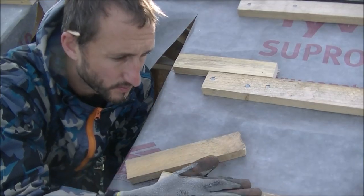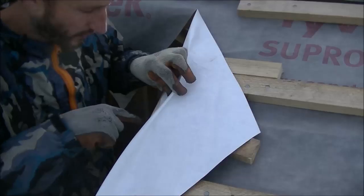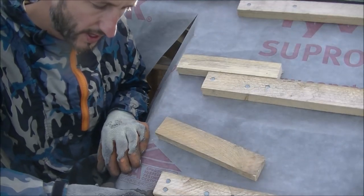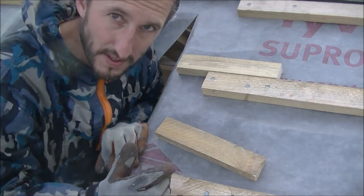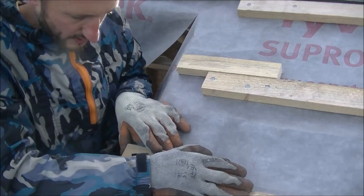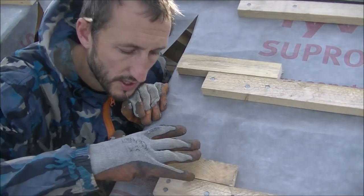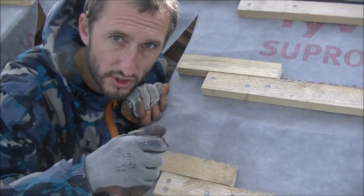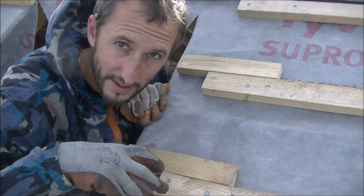Now this bit here — when I've just moved that frame, I've obviously got some baton to make up to the end here. If I fold that over you can just see the end of my timber there. Rather than fit this bit on the end here, because I've got no rafter to tie it onto, I'd have to cut this baton back. So what I'm going to do is just put these offcuts of baton just over the top of each of the others. This doesn't actually matter because you obviously have the flashing kit and you have the aluminium soakers, and they're attached by just using clips — you don't nail them through.